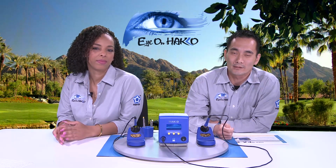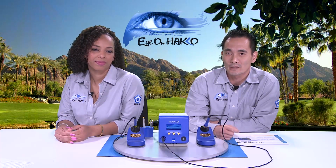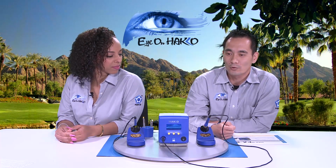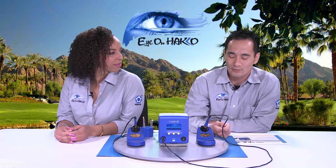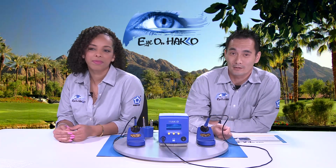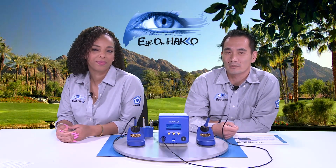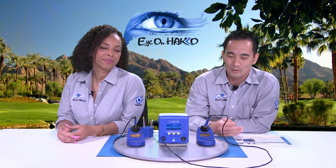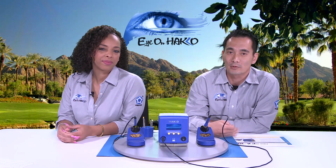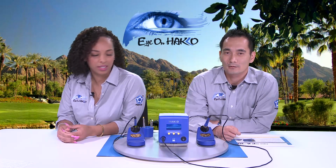The redesigned tip construction and also the consistency in the coil design give the T31 tips tighter accuracy within the tip temperatures, and also the iron plating that we put on our tips. Those are the benefits compared to the competitors. The tip tolerance in the T31 tips is the same in all the different temperature ranges. It's plus 15, minus 25. That's Celsius, by the way.